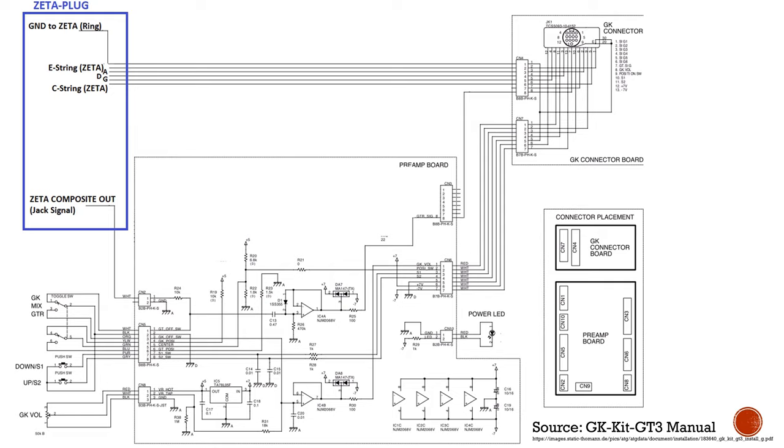You need a composite input which should, in my opinion, be pre-amped — but it is not completely necessary. You can use, for example, a fixed voltage of 5V as the synth volume. For the selection of mode, I would propose to use the mixed voltage, which would be 1.04V — you can make this with a voltage divider. Select 1 and select 2 are not necessary at all, because you can change the instruments on your GR55. Then you can produce a small adapter board connecting the different signals and implementing the different voltages, and you don't need to buy the GK3 kit which costs around 100 dollars.